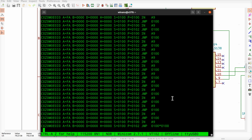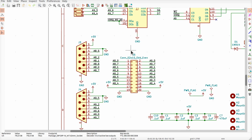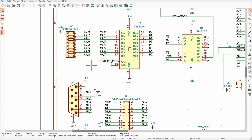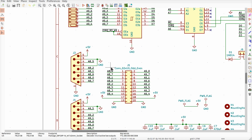So when I tip up the DB9 and kind of play around with the joystick, clearly you can see the values changing. If it all settles down and I hold everything still and just gently press the fire button, you can see that it leaves us with FA. Now, that's a weird value, because if we have 8 bits, that means that more than 1 bit was low. It may also be that we're not coming in good contact with the SIP, but I think it's working, right?